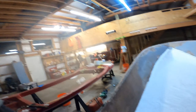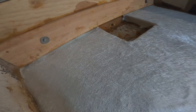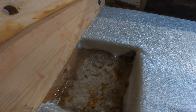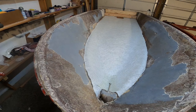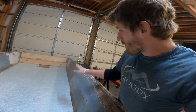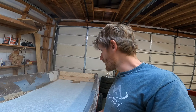So I rolled out the fiberglass, cut it all to shape. Here I have it — it'll be jammed underneath this 2x6 here, and I kind of cut it so it wraps around the bilge pump. It just comes up the side, and then I have just a strip coming down in the bow. It's all laid in there nicely. I'm going to be taking the roll of 1708 and then just coming along the edge and kind of filling in the corner here. All right, let's do this.